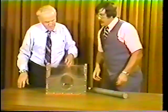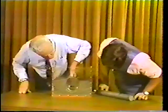All right, Bob, why don't you give it a try? It ain't moving. No moving down here around the haunches? No voids. All right. Now, if you're out in the field, you just go ahead and put your next lift on up to the top of the pipe, and then some material for a little cushion over top, say up to a foot over the top of the pipe. And I'd venture that a pipe placed this way wouldn't settle, wouldn't move.